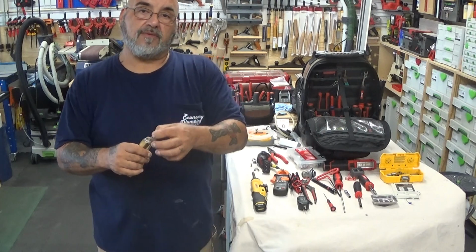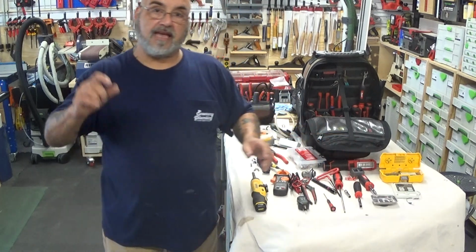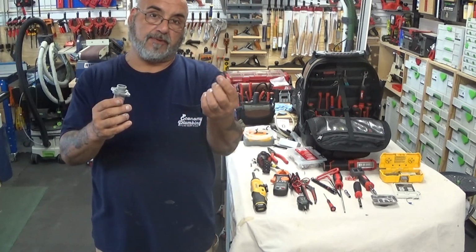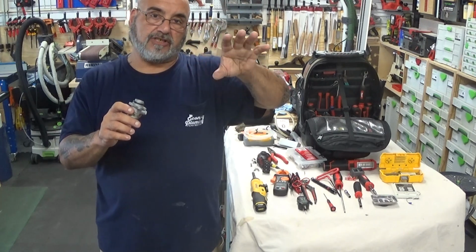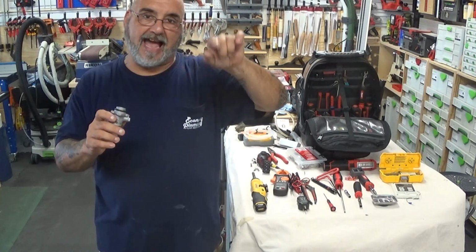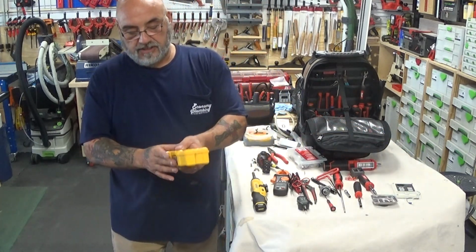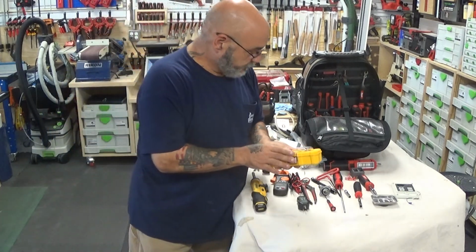When you're changing out either the water servo valve or the gas part, you're going to have the O-ring. Here it is. This one is very simple to remove, but other O-rings have recesses, and they stick in there. The O-ring removal tool helps so you don't gouge the front face of the surface. And I carry this DeWalt box, which is magnetized, and it'll stick on the side of the tankless heater.